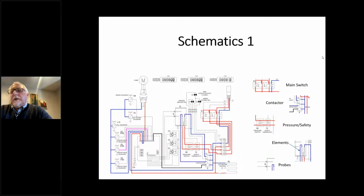One important thing about this common wire when you're diagnosing something: because that wire is common, if nothing works on the machine, even though the power is on, look to the common wire, some kind of break in the common wire, as the fault, because that connects everything. If you only have one component that isn't working, then you can trace it back from the hot leg coming back from whatever that component is back to the board, because that's the one that's isolated all by itself.